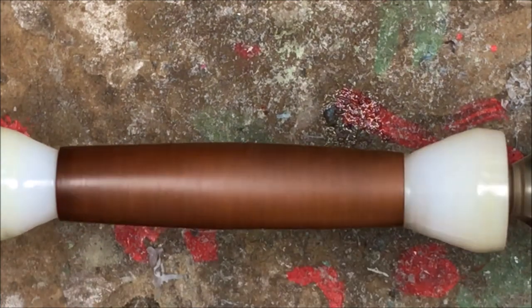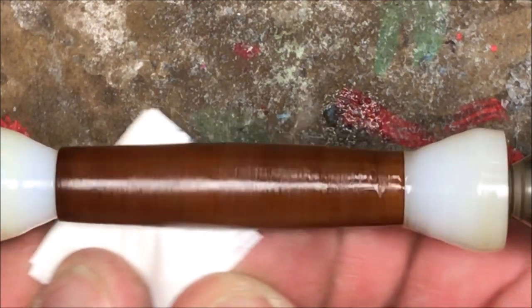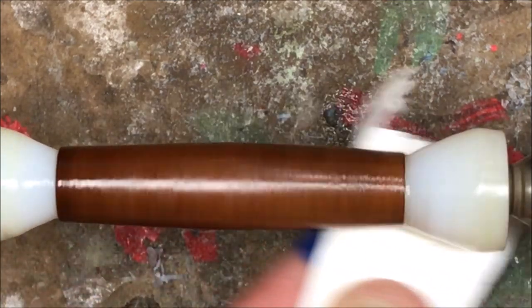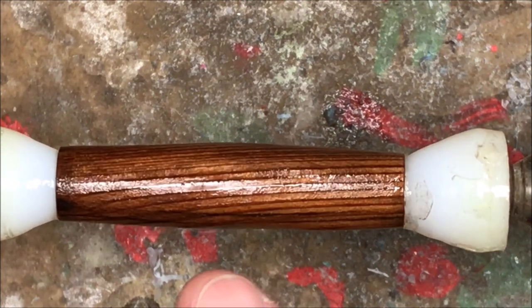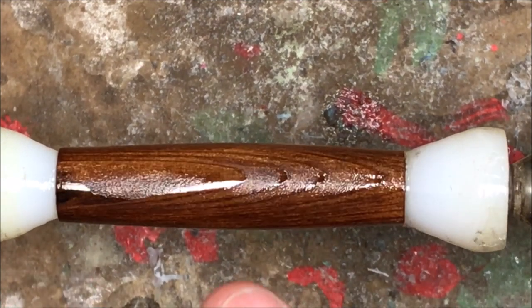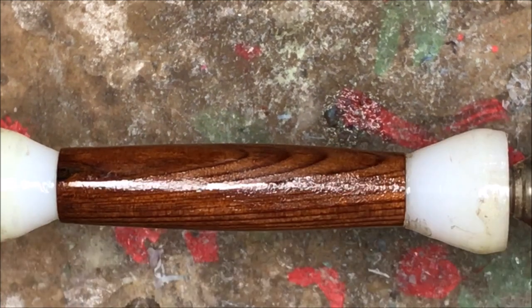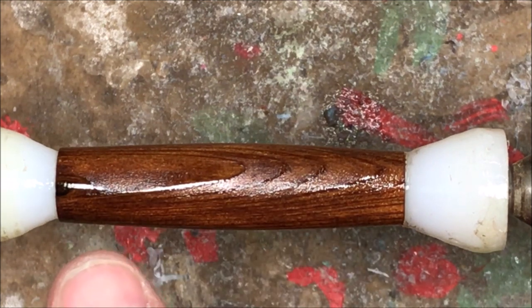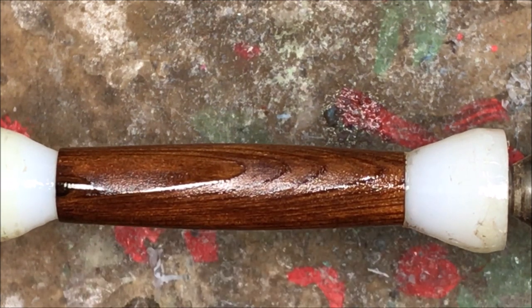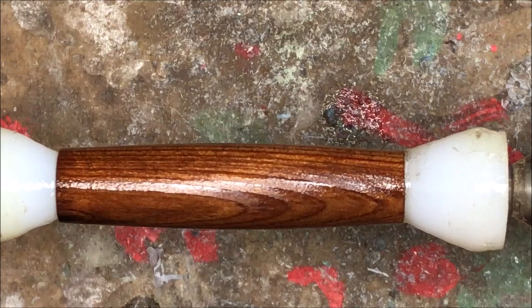We'll just put a bead on there. Notice I'm wiping back and forth a couple times, and I'm wiping the excess off onto my nonstick bushings. I'm going to start building a surface, a nice solid surface, and I will put probably 3 coats to start with, and then I'll monitor the blank to make sure I do have a nice smooth level surface. You can tell because you can see this line right here that is the light above my head. That line will get super smooth and clear when the surface of the blank is finished needing CA applied to it.